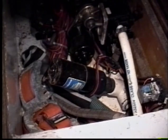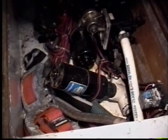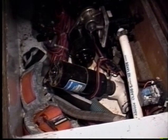Our three sinks and two shower sumps are tied to this pump. It sucks from all of them and then dumps the waste overboard. Being a macerator, it chews up the odd bit of hair and food and doesn't need a strainer. One pump, five drains. It's been working now for 3 years.